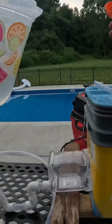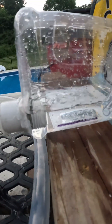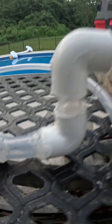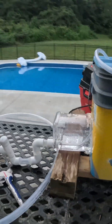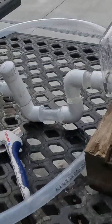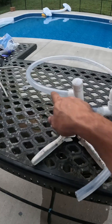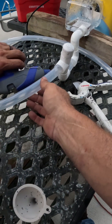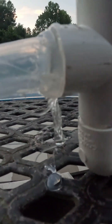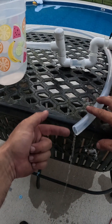One more scenario — don't worry, this is plugged into a GFCI. The air conditioner is running but our trap is dry, so we still don't have any water coming down into the trap. We're still pulling air in fast enough that we're keeping all this water in the drain. Without a float switch that air conditioner is just going to continue running. Eventually water sloshes in and fills up our trap — now you can see all that water running out. Now that we're properly trapped we can see water coming all the way out our drain.